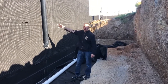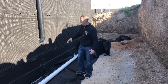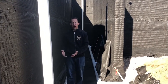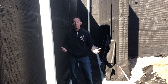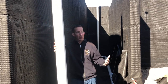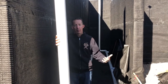There was really no way of avoiding this — it's a pipe that's going to be the sewer line coming up from the first floor level, and it'll drain down into the base level of the first floor picking up all those drains. We've got these tall four-inch PVC pipes in multiple locations. We chose to do this because if this pipe ever got clogged, we're going to have a clean-out at the top so you can run a camera or something down there to clean those pipes out. Schedule 40 is so much thicker and stronger to prevent damage from guys backfilling with a lot of rock and decomposed granite.